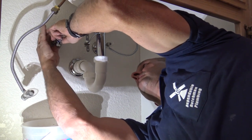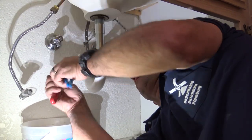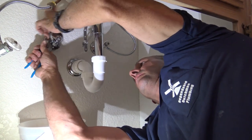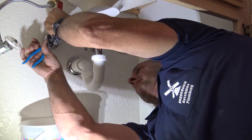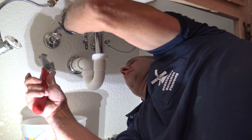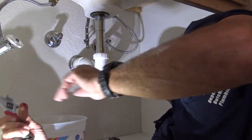Because these are actually plumbed fairly high I'm going to point this stop down, then screw on that back nut. Once it starts to compress you can feel it. I want these to be straight down. Go ahead and crank it down — and that stop is replaced. Make sure you keep them in the off position when installing them, so when you turn the water back on you don't walk back into a flood.